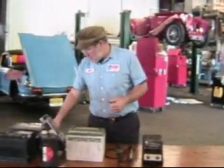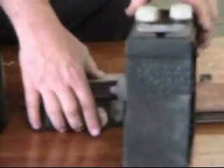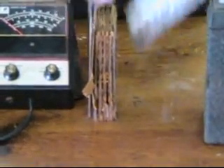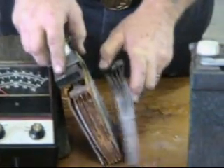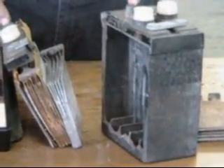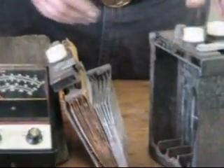Let's take a look at the inside of a battery. This is out of an old 6-volt battery with the exposed terminals on the outside. Down inside here are the plates — we've got the spongy lead, which is located in some little fibrous envelopes, and then we've got the lead plates which are slid between each other. Sulfuric acid is run on the inside, and when it's fully charged, the fluid on the inside of the battery is sulfuric acid. When you discharge the battery, you connect the posts together and begin to draw a current. That sulfuric acid works on the lead plates, releases the electricity that's inside the battery, and finally turns into water, at which point the battery is dead but not bad. This is a six-volt battery with the two different sets of plates in it.